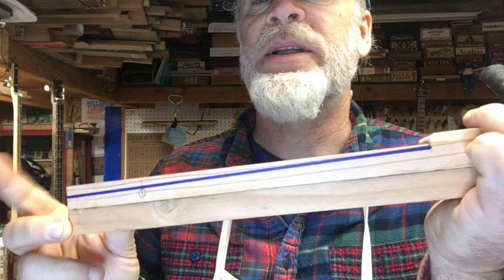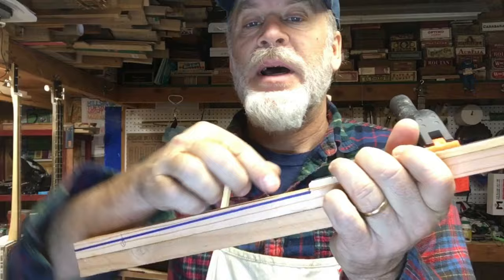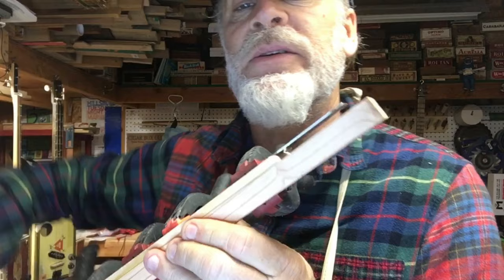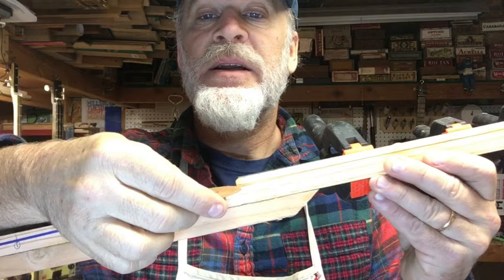So this here, I'm gonna go cut it out now. You want to make sure to take these screws out before you start cutting this, because you don't want to ruin your saw blade. Now, I also am going to cut this little section out, and the rule of thumb is I use the same gap here. So I'm gonna cut out this portion of the headstock as well, and that's just so the tuners can reach through here. But I usually use the same gap or the same depth here as I do over here. You don't have to, but for me it's just easy to set up the saw blade once